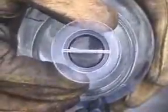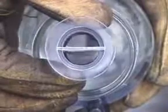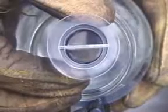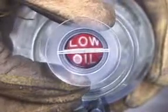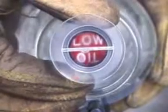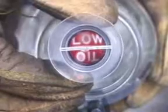In a fluid, the light travels straight down the acrylic shaft and into the fluid into which it's immersed. It does that because as the light hits that prismatic bevel, being immersed in a fluid, it's unaffected by the prism effect. It goes directly into the fluid. However, should the fluid level drop below the gauge level, what your operator will see is a clear indication in bright red and white of a low oil condition.